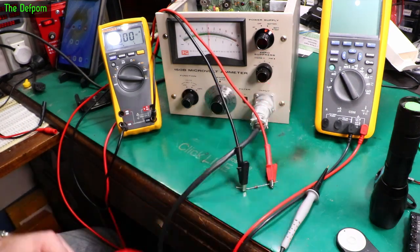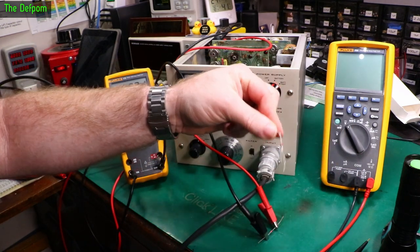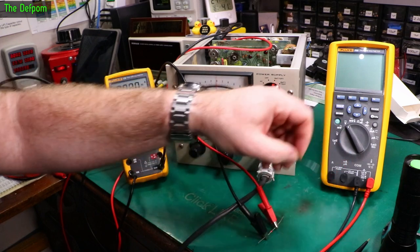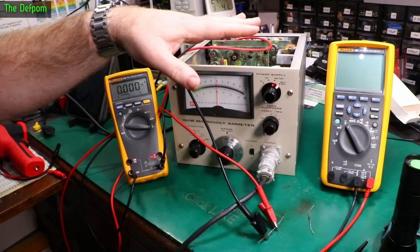Yeah, interesting experiment. So I'll just try different Zener diodes. This one here is the 6.2 volt which we tried before, which was drawing about a quarter of an amp, which is like its maximum charge current. This is basically simulating what the battery would be doing, from what I can tell. But that's a lot of power dissipation going on in here.